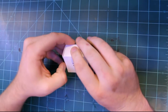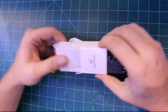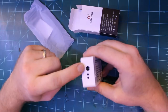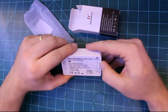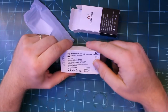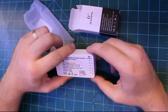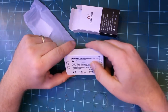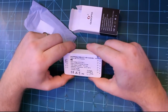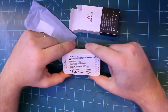The last thing I'm going to show you is this RGB LED strip controller. The cool thing is it's also Philips Hue and Zigbee compatible, and it's compatible with multiple different types of LED strips. It takes a 12 to 24-volt DC input and on the other side you hook up your RGB or RGBW LED strip wires. This controller won't handle addressable strips like WS2812, but it supports full-length RGB strips at 6 amps per channel, up to 15 amps total — so theoretically you could control a string of up to around 300 LEDs.